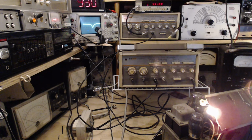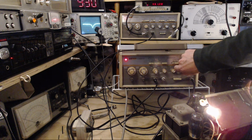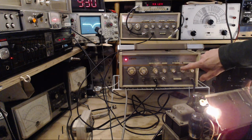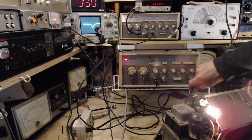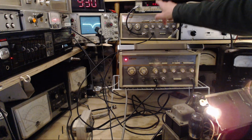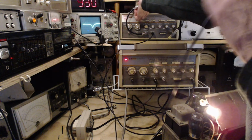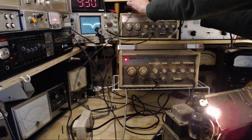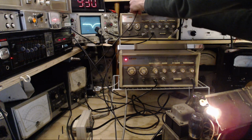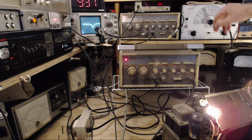like that. Well, the first step, let's turn it on. Make sure, yeah, good, red light comes on. What we'll do is we'll hook the output, the sweep output. Now we'll hook the sync output to the frequency counter, just like this one is. This is kind of, I don't want to say a cheating way, but it's a way to get a signal out of the signal generator strong enough to trigger the sweep generator and be independent of the actual test output down here, which has all kinds of padding and stuff you can fiddle with.